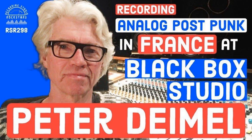Is analog tape part of your signal flow? Yes, I record maybe 90% of sessions here on tape, at least at the beginning. We have two multi-track machines: an MCI JH24, and a Studer A820 which has a 24-track and a 16-track head block, both two-inch. The Studer is such a great tape machine — the transport is amazing. The Studer is my main tape machine now, and the MCI is just a B machine in case we have a problem. People joke that MCI stands for 'most connections intermittent' — I've been through all those issues. I exchanged every single IC support on the JH-24; they were all half-rotten, really bad contact problems.